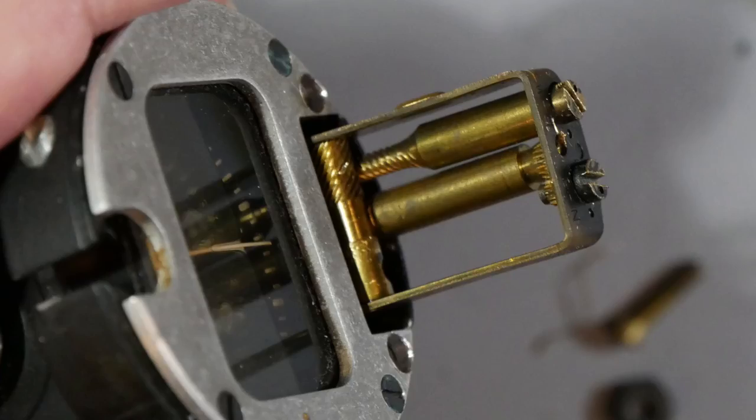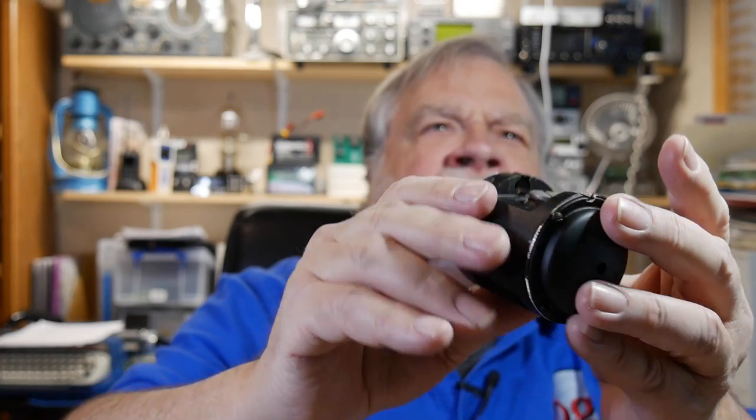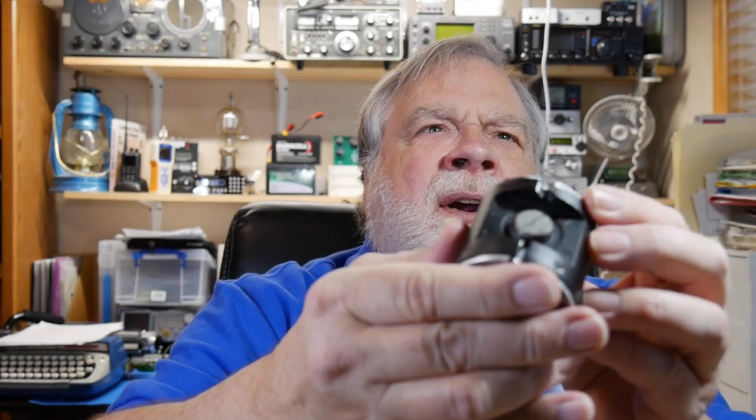This assembly slips in so that those little pieces are right underneath where the compass is — the compass floats in alcohol. Those are the adjustments, and then screws go in to hold it in place. There's also a little tiny light bulb. I tried lighting it up, but I think it's a six-volt bulb and I gave it 12 volts and blew it out. That was stupid on my part — I should have started with a variable power supply. So that's what's in an aircraft compass.